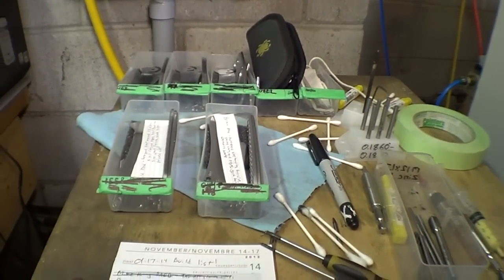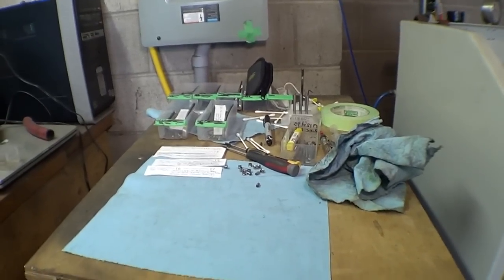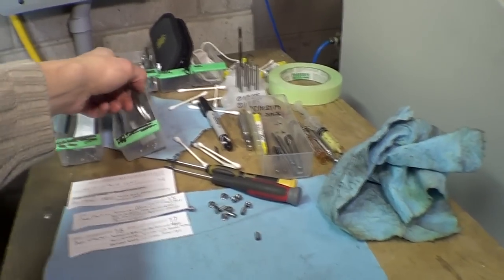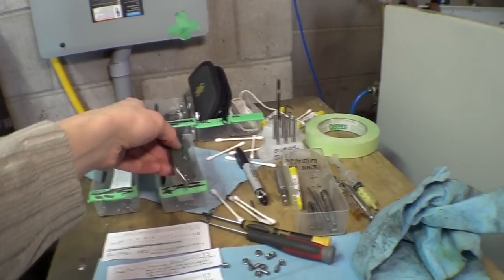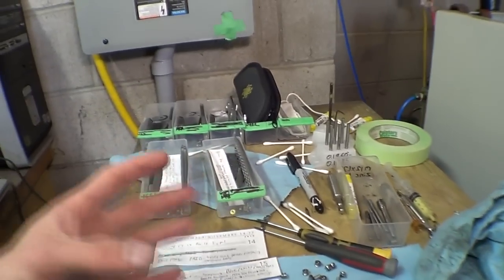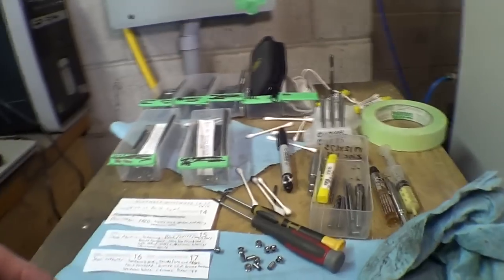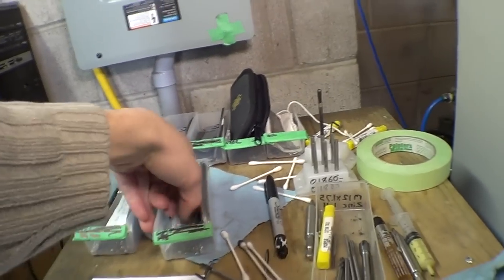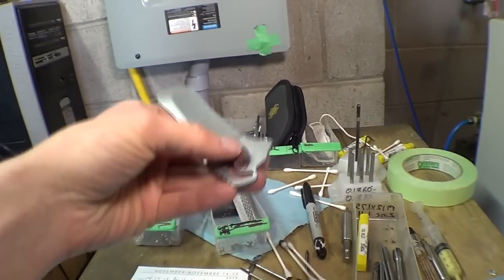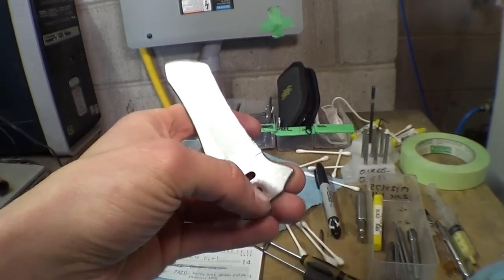And in the near future, I do want to do an assembly video, like a setup video, where I go from, you know, these parts right out of the tumblers, stonewashed. They're all deburred and everything, but they're not set up yet. There's still some reaming that I have to do. There's still some chamfering of important holes and stuff. In the blade, since it's now been heat treated and finished, I have to ream out the pivot hole to the proper size.